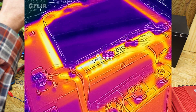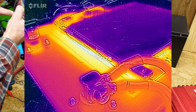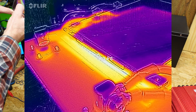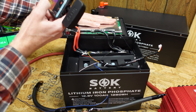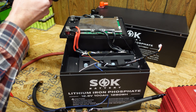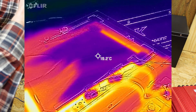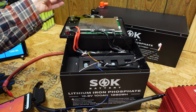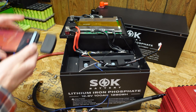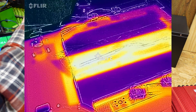There's 60 degrees — underneath where the FETs are. I can see 61, 62, 63. That BMS is very hot. I'm not getting a temperature on here because the thermal camera is reflecting on that surface. I'm going to stick a piece of Kapton tape over the BMS here and see if I can get a temperature of the heatsink. 60 degrees Celsius — so it's agreeing with what I saw of the FET transistors on the side.